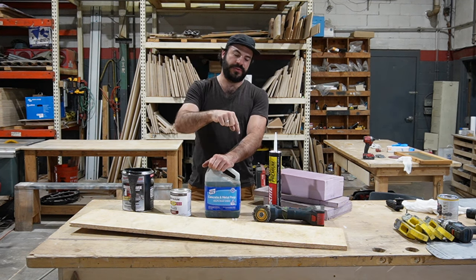Well, anecdotally, I used this in an addition on my house, and I've had a pile of scrap wood in my backyard for the past year, and some of it included this Advantech subfloor material. After a year, including going through winter, being totally covered in snow and freezing and thawing and all of that, it still looks the same. It has not done the thing that typical OSB does where it expands. I'm sold. It's a superior product.